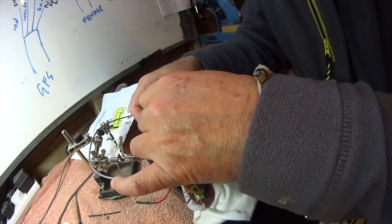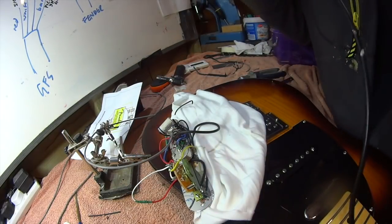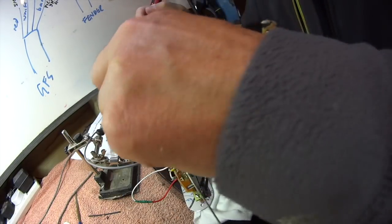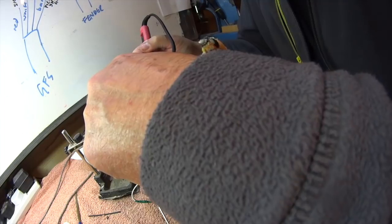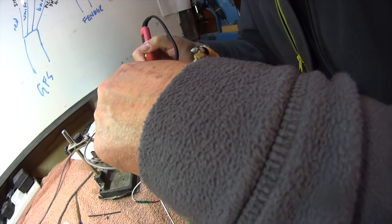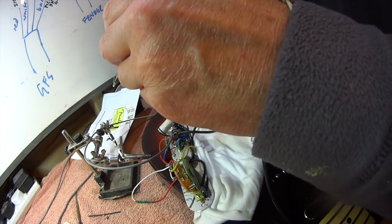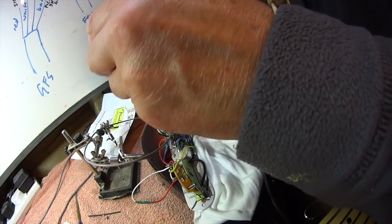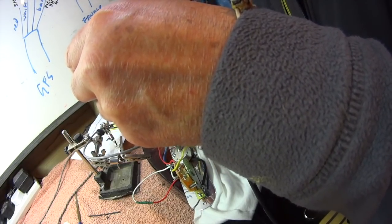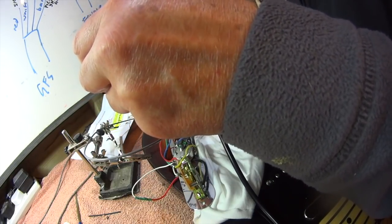Now for a minute I'm just going to hike that out of the way, and I'm going to make a new bit of solder again on top of the pot, because I don't want the others to spring off and then have to contend with reattaching all of those in one go, because it's actually quite difficult to attach several wires all with minds of their own on the top of a pot. It's like herding cats. Okay, on you go.